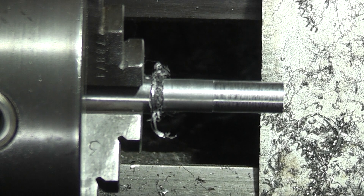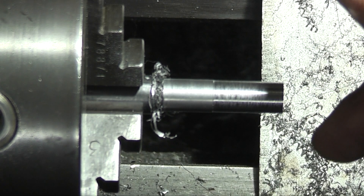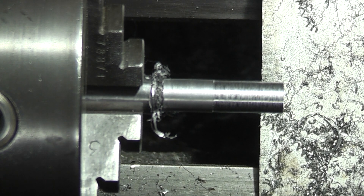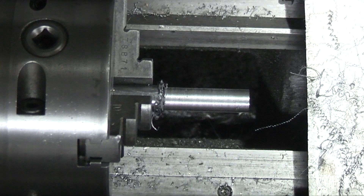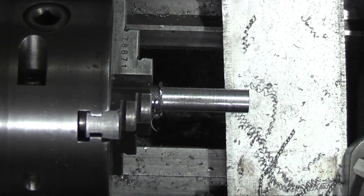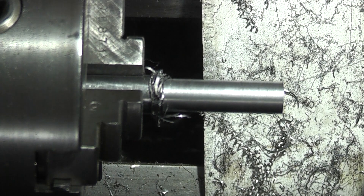So on that one I would say mild steel, speed about 850. What you must remember is that as the diameter gets smaller there's less surface speed — your cutting speed is actually slowing down. So you need to play around with the tool speeds and feeds to get the best finish you can. This finish was with the carbide insert, this finish was using the high speed steel tool — another carbide insert finish and finally the high speed steel tool finish. I think high speed steel gives a better finish for the speeds and feeds I was using on the mild steel. It's difficult to show the surface finish on video but I hope that was useful, hope you enjoyed it and we'll see you next week on E-Nuts Engineering.